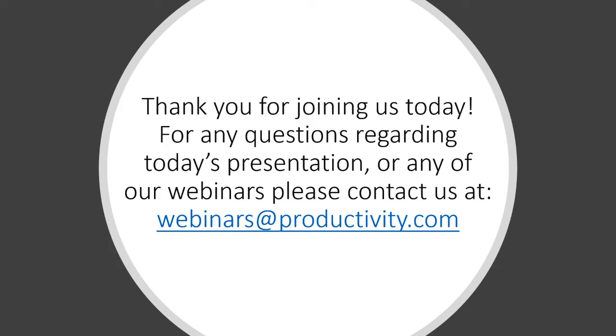Okay, thank you. Also, can we measure tool length non-rotating off center like a face mill? So yes, you can. That's in there where one of the options that we have on the machine is to do a manual. So you would have to position it there and then line up the cutting edge and then run a manual set. You couldn't do it the way that I was doing it there, but you can do it, yes.